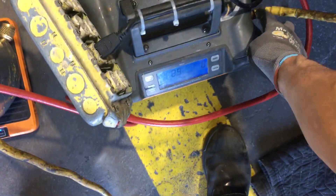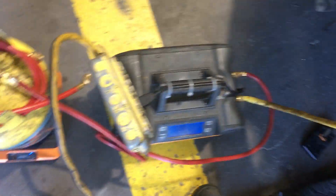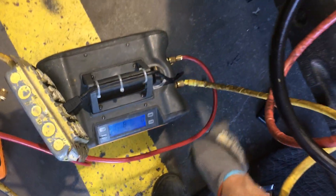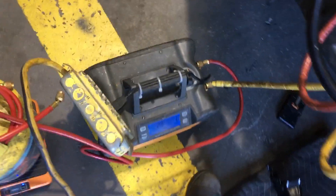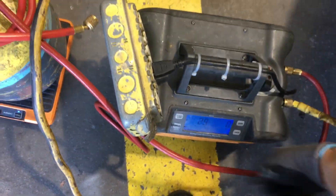What we're right now doing is pulling from this point. It's already under microns there, but any trapped air in there is getting flushed out. As you can see, it's under 29 inches of vacuum right now throughout the system.